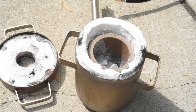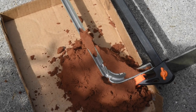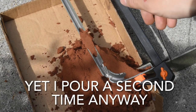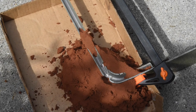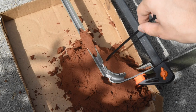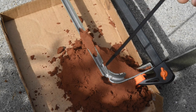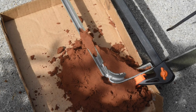I have all of the metal inside the crucible ready to be melted — scrap aluminum from old soda cans and fire extinguishers. The furnace is running and I am working on this mold. I'm not taping a lot because this is a very delicate process and I want to make sure it's done carefully and done right the first time, since there's really not a chance for a second pour. Ordinarily I would hate to use a cardboard box, but that's all I have on hand. I have extra space here for the missing section, and I'm carving out the extra channel sections cut into the frame so the aluminum will flow in and grab that section. This is refractory clay, so it shouldn't burn and should hold the metal just fine — I've used this for casting typewriter parts many times before.